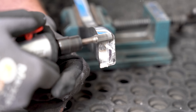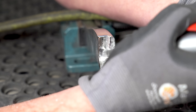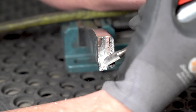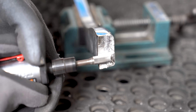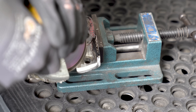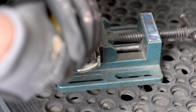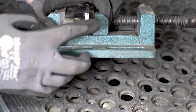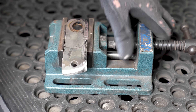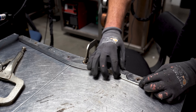The reason we do this is so there's an abundance of fresh metal in place when we go to cut this corner back out after welding. If we simply cut a small groove and then whacked it all back down after welding, it's definitely going to crack again. So we have to fill in a bunch of new fresh metal which is going to be stronger. On the smaller piece, I ground about a 50% bevel into it with my flat disc and grinder. The reason for only taking down half is because I need the mechanical lock of the fracture itself to serve as a natural position memory. This is how we will keep it completely aligned once welding is complete.